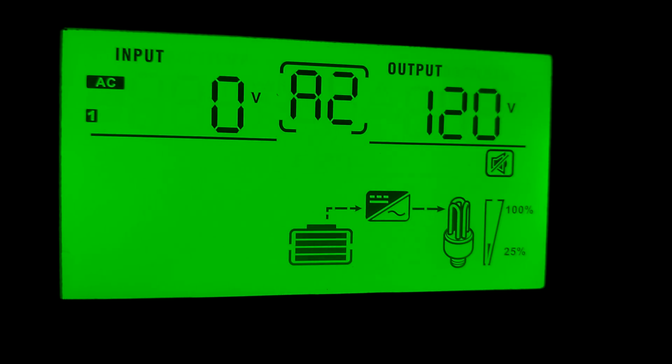Now this right here is the voltage, 44 volts. When I got the grid power on, at 44 volts, it'll automatically transfer back to the grid. So we'll start pulling off the grid so it won't take the batteries all the way down. Uh-oh, it's talking too long. Let me get that back. 44 volts. Okay, we got 56 volts. That right there is when it goes back to 56. It will transfer back from the power grid and go back to using the batteries.